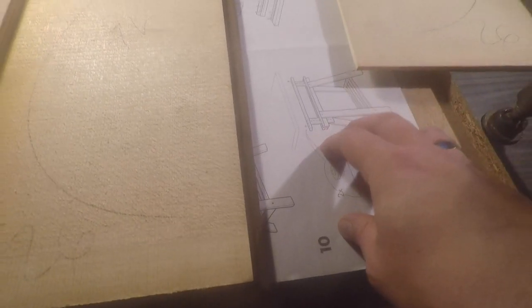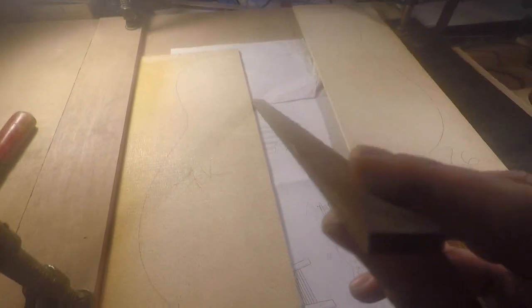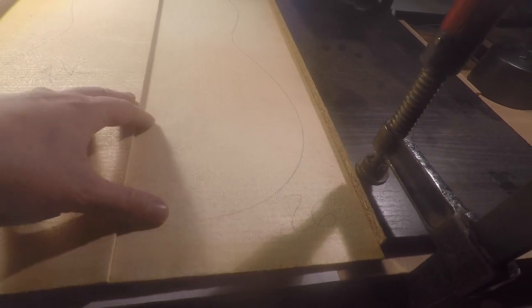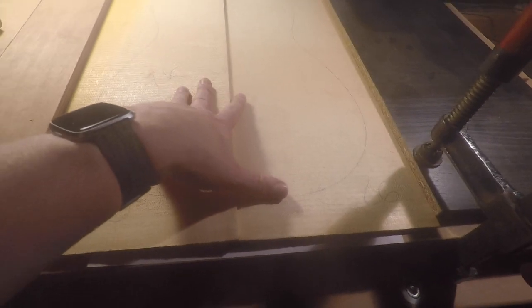So first we lay some paper, and then in the middle we put a little piece of wood. It goes underneath the two sides of the top plate. Then we lay the two plates together, and at the sides I tried it once to see if it fits, so now I can put them between the two plates in one time, but that's no problem, that's what we want. So we lay the two sides of the top plate next to each other, and on both sides we clamp a totally straight piece of wood.